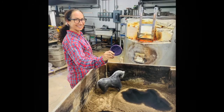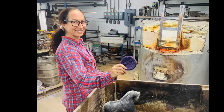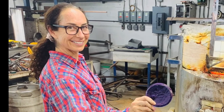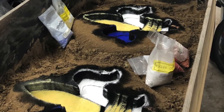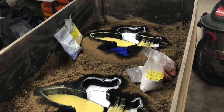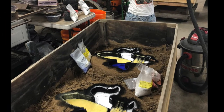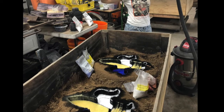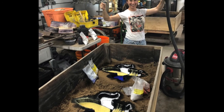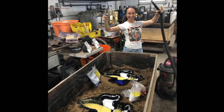In this picture you see I'm holding a lavender glass that I melted down — so the whole day I was pouring that color — but typically I work in clear glass. The way that I color the pieces is I add powdered glass to the bottom of the mold. Here I'm showing you the bags of powdered glass that I sprinkle right onto the sand to give the surface color. About 10 years ago I started melting down these solid colors that I was recycling, and that glass is a little bit more dense and rich.